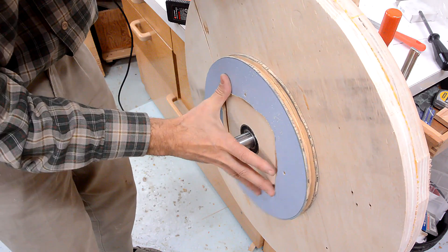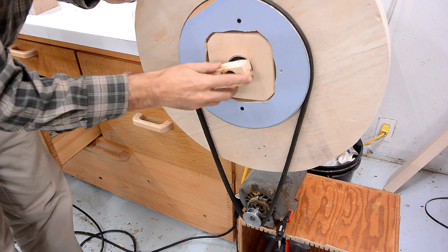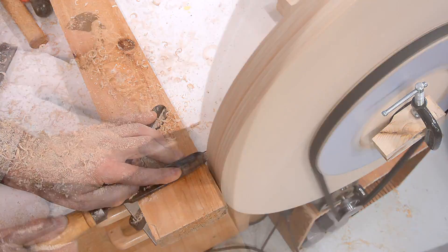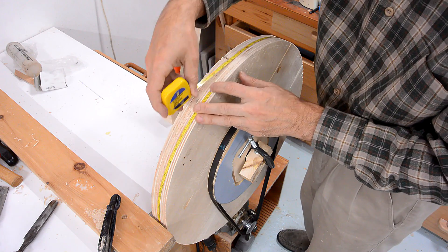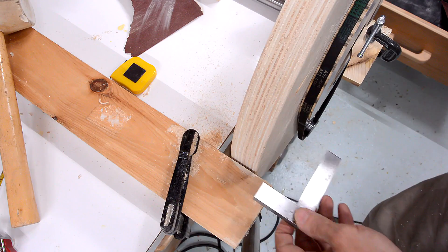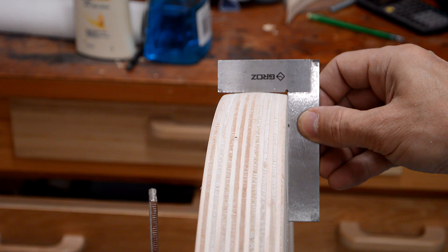This is now my third bandsaw build that I'm using this temporary pulley, which I made out of a piece of plywood by cutting some slots in it on the table saw. If you're afraid of doing that, you can just use three layers of plywood. I have a small utility motor — 1750 RPM with a two-inch pulley — and I'll use that to spin up the wheel. This clamp on here makes sure the pulley doesn't slide away. The actual circumference I'm aiming for is 156.4 centimeters, and right now I've got 161 centimeters, so I've got quite a bit to still turn off. I've now got the wheel turned flat and to the right radius. Now I just have to turn a crown onto it. The crown is turned and sanded — this wheel is done.